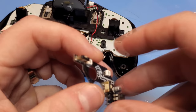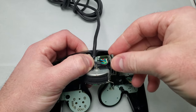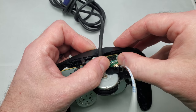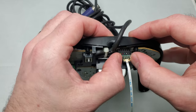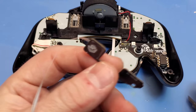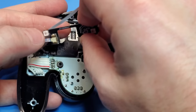That didn't really stop us from coming up with a solder-free option. The solder-free version of this mod is identical to the previous method, with the only difference being that you put the adapter board into the cable header socket that holds the cable to the controller PCB. From there, it's simply a matter of running that flex cable to the main ShineWave PCB, and the rest of the install is no different. The only downside is that repeated insertion and removal of the solder-less adapter will eventually wear down the cable header plastic over time and make the connections not very solid — again, the reason why I prefer the solder method. But it worked really well for us in testing, so we figured it might as well be an option for everybody.